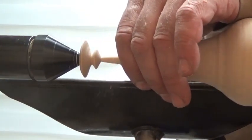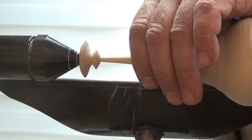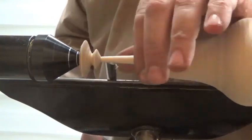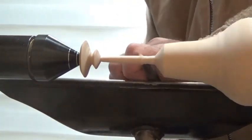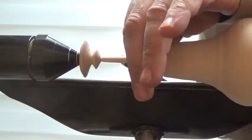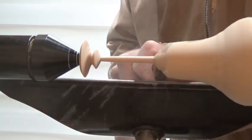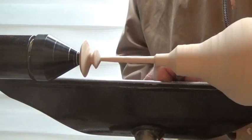You'll hear a little bit of vibration because I'm quite a long way from the chuck, and you can hear the vacuum in the background — that's the vibration there. I need to support the wood a little bit with those cuts when the wood is so thin, so that it doesn't break hopefully. Trying to work it down to about 1.5 millimeters without breaking it. I think maple is a good choice of wood for this kind of project because it's pretty stable and solid.